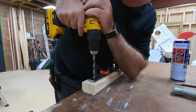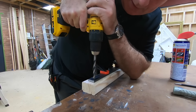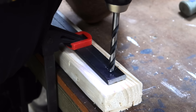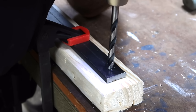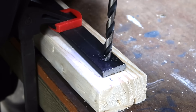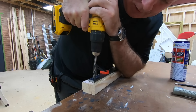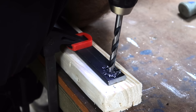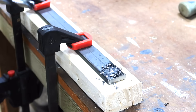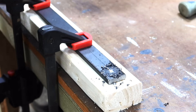Starting to put quite a large weight on this and then starting really slowly. You can see immediately those flakes of steel starting to come out, which is a really good sign. If after a few revolutions there's no sign of chips or spirals of steel, you need to stop and reassess the situation. This is a time that most people will speed up to try to get into the steel, which is absolutely the opposite of what you should be doing. That's a nice start — it's better to get some big spirals coming out, but that's a good start.